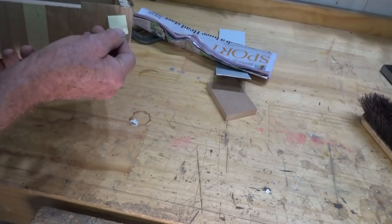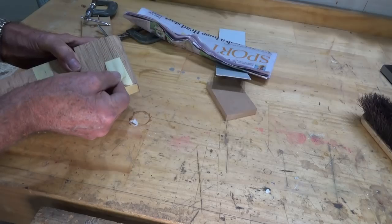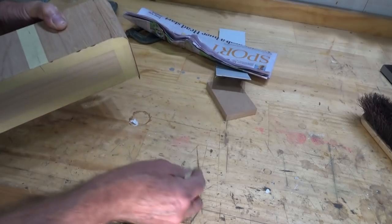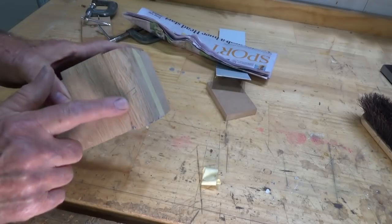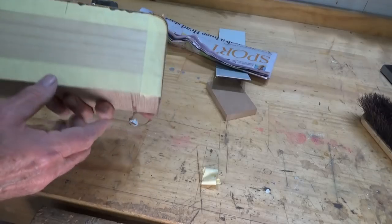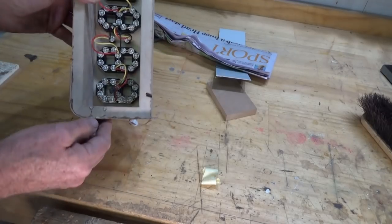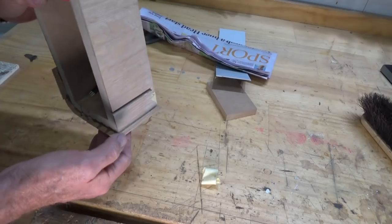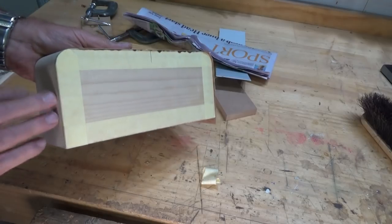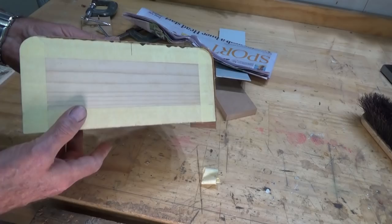Okay, doesn't look too bad. So the joint there is very good, that'll clean up okay on the glue line, sanded off that. I'm going to trim up some of this veneer. It's still a bit wet on the back there actually. I'll get this trimmed up, and then I'm going to do the other one off camera because it's essentially the same thing. Then we'll come back when it all gets trimmed up and have a look at the end result.